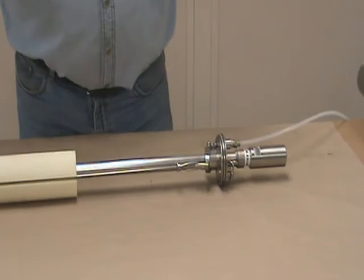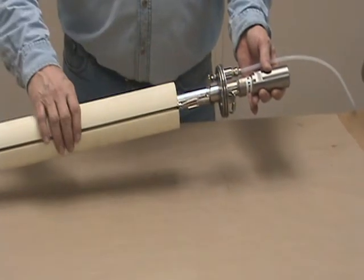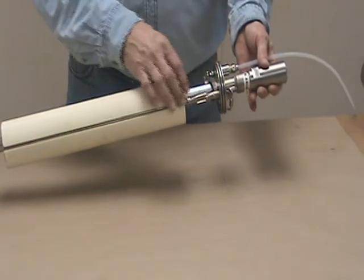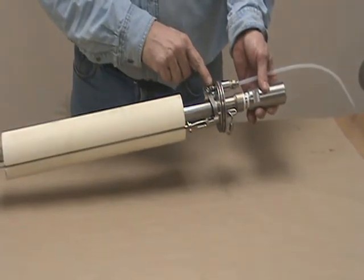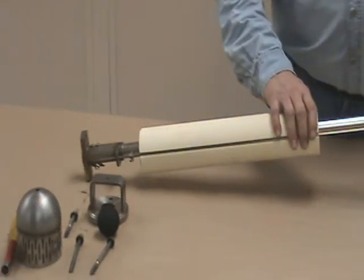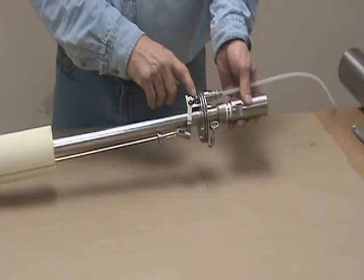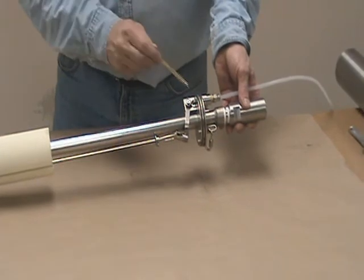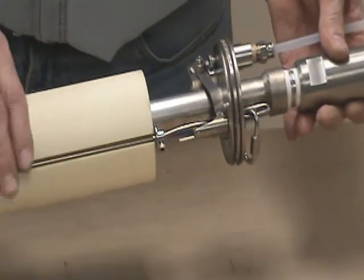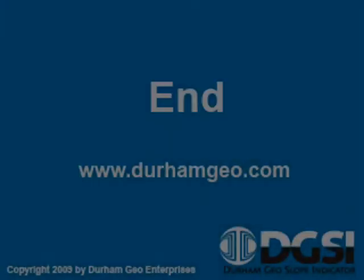We can supply up to 125 psi with this pump. Bring the float up to the top control stop and slowly push it forward. The magnet force should be strong enough to open the valve, as you can hear. Air will be entering the pump and pushing the fluids out. Push the float down to the bottom control stop and you should hear no more air entering through this air valve — the air valve seat right here. We can do it one more time: air rushes in, the bottom pulls it off. So we've checked the air valve.